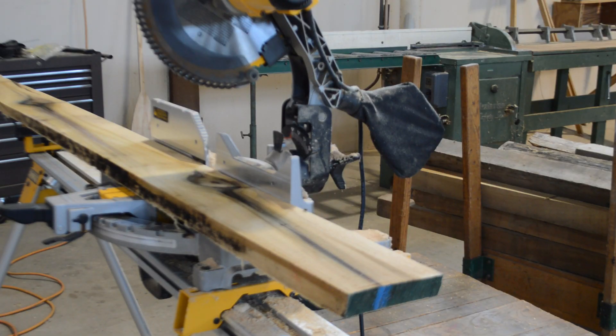The boards that weigh boards are sawn from should be representative of the rest of the boards in the lumber stack in species, thickness, and moisture content. Ideally all the lumber in the stack was sawn at about the same time. If otherwise, then the weigh board should be sawn from one of the greener or wetter boards.